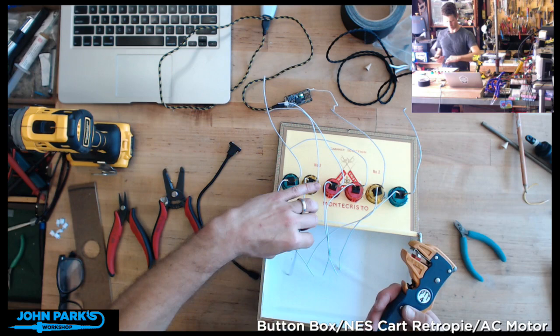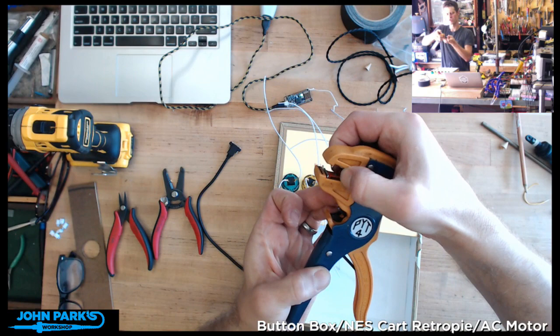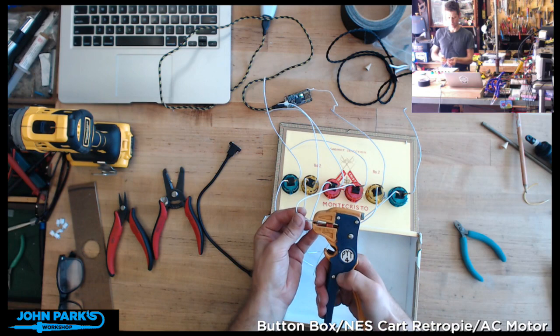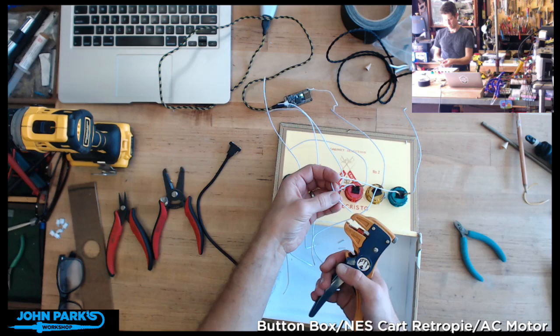Let's see, if I'm twisting these together, I need, so I don't know if you use these kinds, I was avoiding them last time because I was using really thin wire, but you can change this little stop so that you can adjust how much length you get when you cut and tug the little wire off. These things are great. I saw that Noah and Pedro now have a new wire stripper, I think Noah does, that is two sort of mouths that bite and yank across the razor. I've never had a set of those.